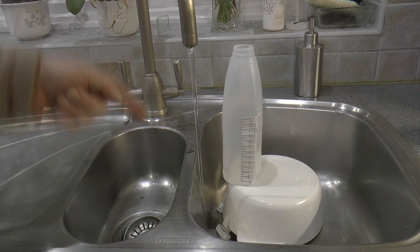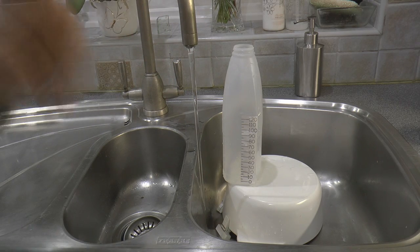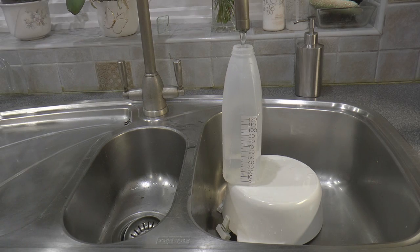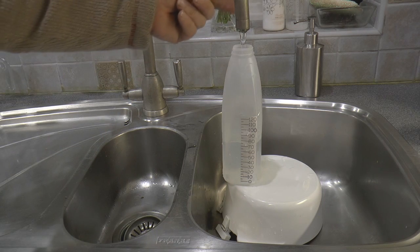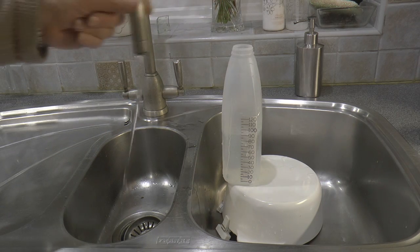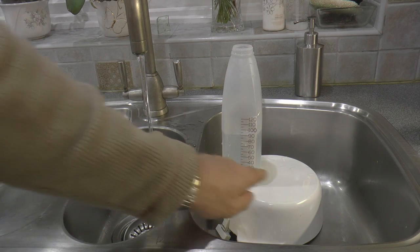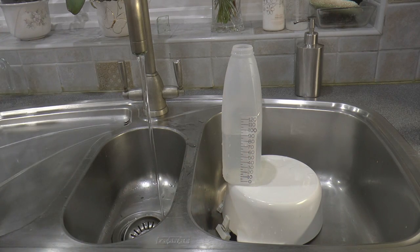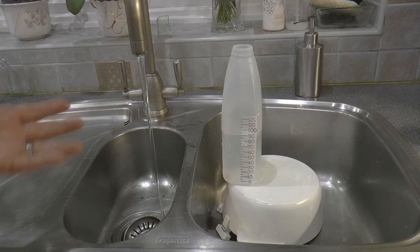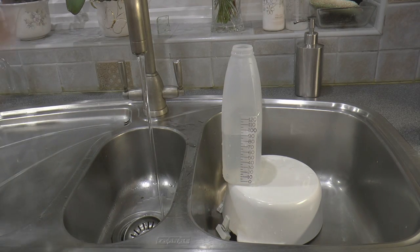So what we're now going to do is to run our steady stream of energy into the calorimeter for a fixed period of time, and that's the important thing. We're running the heat energy into this aluminium block for a specified period of time, and let's assume that that's the specified period of time. Now at the end of that block of time, we can look at the temperature rise, and it's gone from 10 to 90. That's a rise of 80. Now that rise is equivalent to the amount of heat that's stored in that block. Very simple. That's what calorimetry is all about.